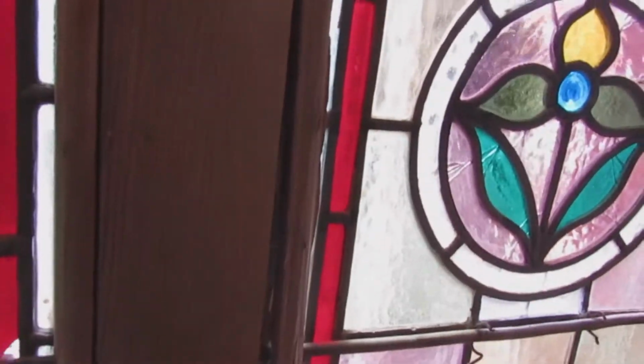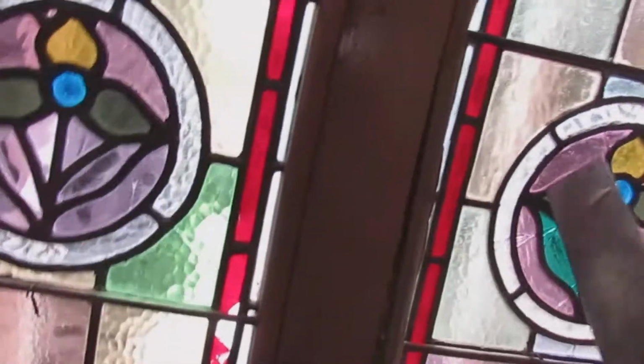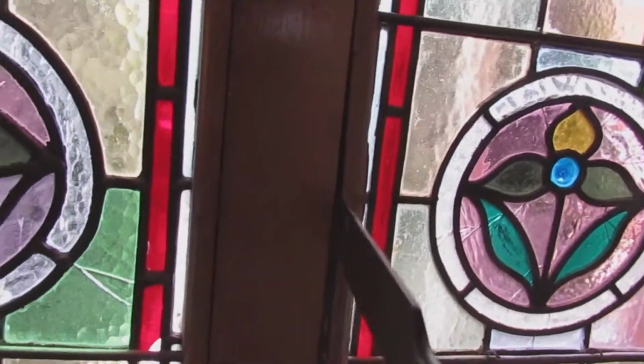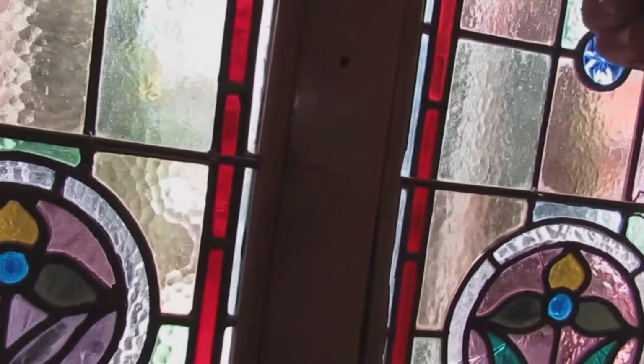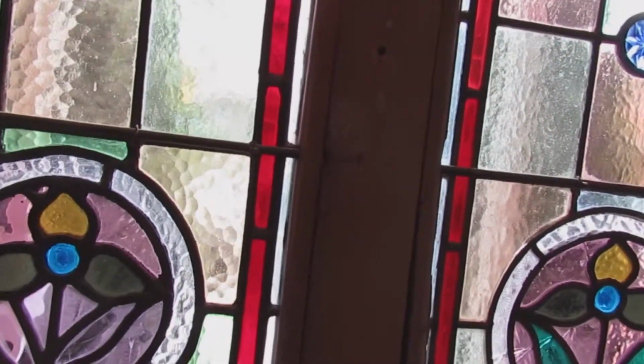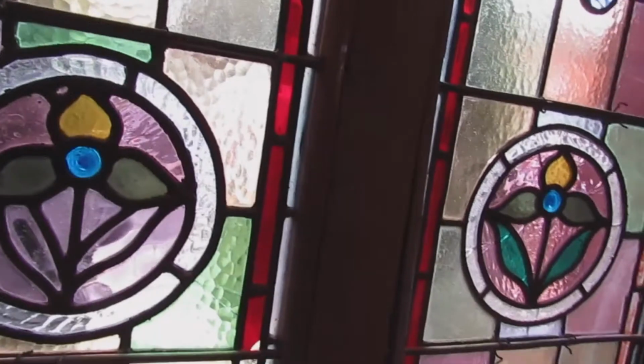This isn't puttied in, this is put in with beading. So I'm not going to film it, but the way you approach it is you slip your chisel in and you lever, and you start on a long side because you need to pop these corners out, and you'll need a bit of a bow.